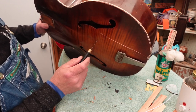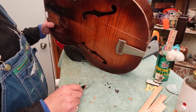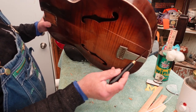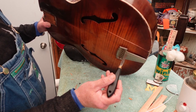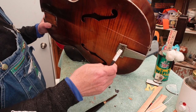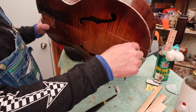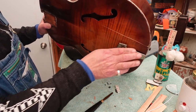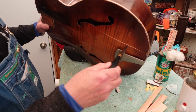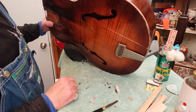I'm going to put a piece of patch over here that will be appropriate to one of my junk pile guitars. But in order to do that I need something to screw that patch to. First I need to level this out as much as possible — take my palette knife, see where I need to take this little scalpel and get rid of the wood that's hanging this up right here. I need another cleat right here to pull this up into place, and when I put the palette knife in here it will line up if I bridge it. So I need to pull a cleat in from the bottom and glue it.